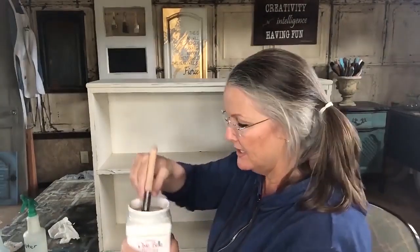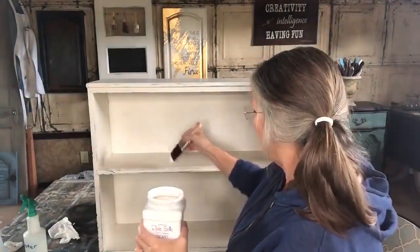Since I'm painting it white, I'm going to use a product called Boss. Boss is a stain blocker and it stops bleed-through. It comes in white and in clear. Since I'm painting it white, I'll use the Boss in white to base coat the whole thing — that way I don't have to worry about any bleed-throughs. Boss is also great for blocking odors, so if you have a really stinky piece, just put a coat of Boss on it. I've stirred it well and the brush I like to apply it with is the Dixie Belle Mini — one of my favorite brushes. I'm going to go ahead and put one coat of Boss on. It's super easy to put on and it covers pretty well.